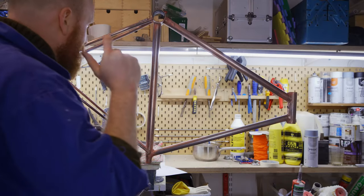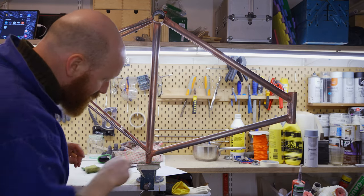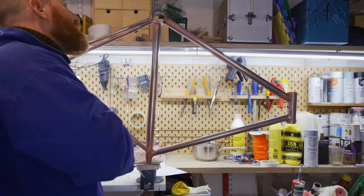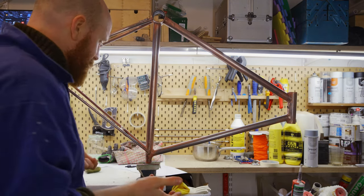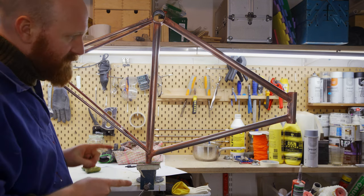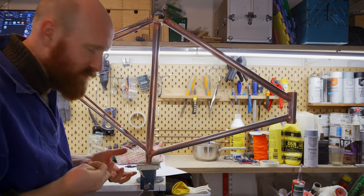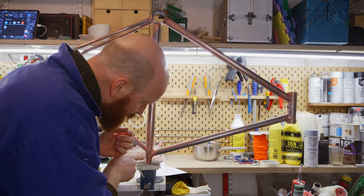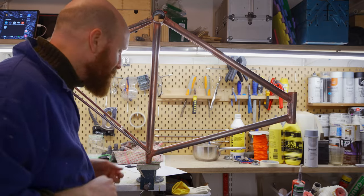Yesterday we did the copper and it didn't catch everywhere. There's bits that are really thick and beautiful and smooth, and bits that are still really grey. I rubbed it down with steel wool — the steel wool took loads of it off, which means it hasn't stuck very well. I thought this was a chemical process, but that might also be because I didn't degrease it properly. So today I'm going to degrease it much more thoroughly and give it a second coat, because the bits of steel that are still raw will still catch. The science community can tell me in the comments if I'm wrong.